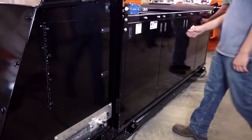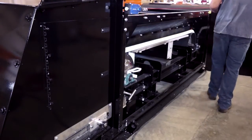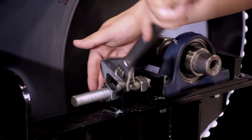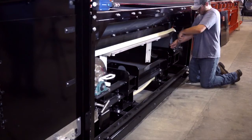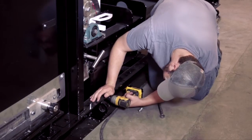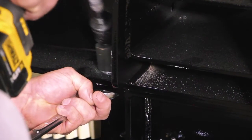Start by removing the doors from the side of the unit. Loosen bolts and nuts on the tail pulley on both sides of the machine. Loosen the floor and other bolts including the belt chain bracket assembly, removing the supports and brackets. The three supports should be removed under the cantilever prior to removing the belt.